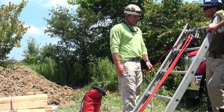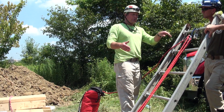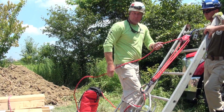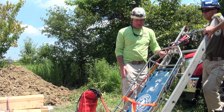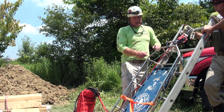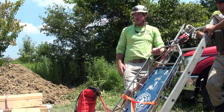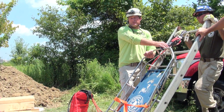We package the victim in the stokes and when we're ready to haul up, we make sure that the base of the ladder — the feet of the ladder — are footed well so we don't have such a shallow angle that they kick out or slide into the trench. We simply haul and up comes our victim nice and easy. When we get to the top side, we'll have some other points up here to capture the stokes basket so that when we clear, we can swing it out, set it on bridges if needed, get everybody in position, lift out over the popsicle sticks or the top of the strong backs, and get them into a position of safety. That's the quick victim retrieval technique for level one and level two trenches.